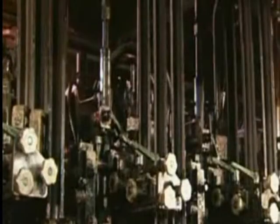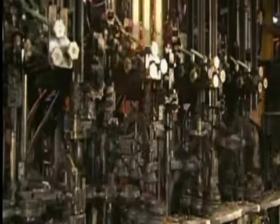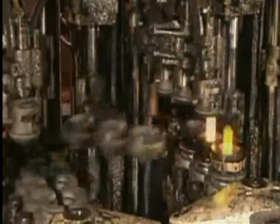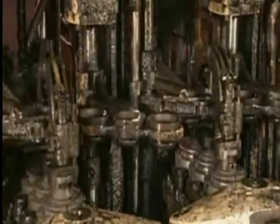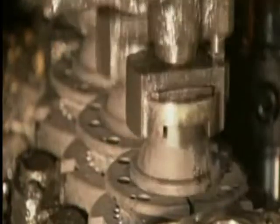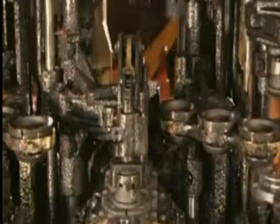They drop to a device called the scoop. The scoop moves them to troughs that feed them to jar-forming and bottle-forming machines. A glob of molten glass goes into a preliminary mould. In a matter of seconds, it comes out as a miniature version of the bottle, known as a parison.